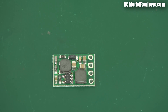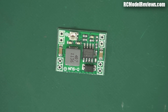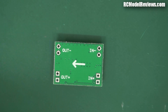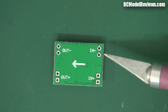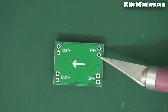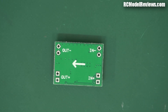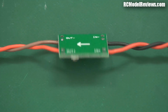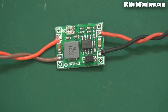Here's the simple little buck regulator. Wiring it up is pretty straightforward — if you look on the back it's got in and out, plus and minus. All you do is wire the input from your battery with positive and negative to their respective pads, then wire the output from the other pads. It gives you two pads for each connection, so it's not a difficult soldering job. Just put some wire through there and solder it up — done and dusted. In and out, piece of cake. Now I'll set it up on the bench, fire some power into it, and see how well it regulates and what load it can take.